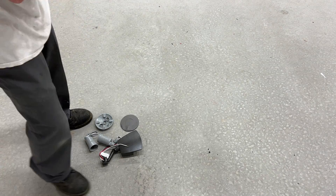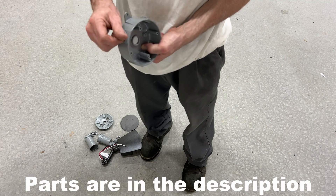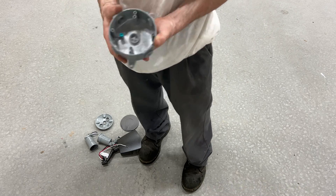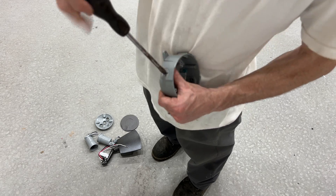We're going to start by being on the ground, not up in the air. First thing we're going to do is screw in all the threaded knockout plugs other than the one we need for the UF connector, then install the ground screw. After that, we're going to tighten them all up to make the box weatherproof.